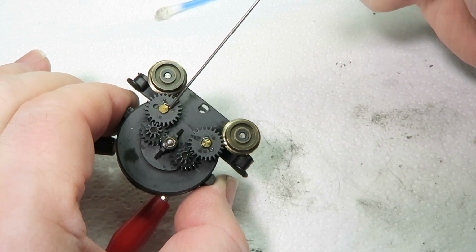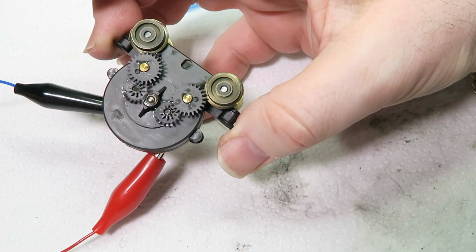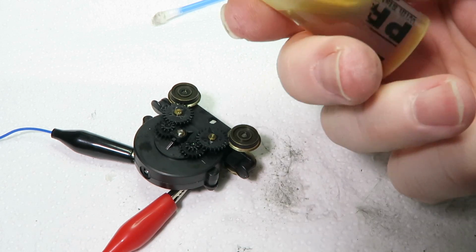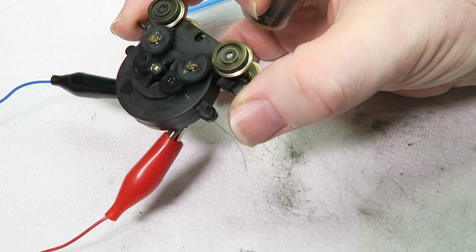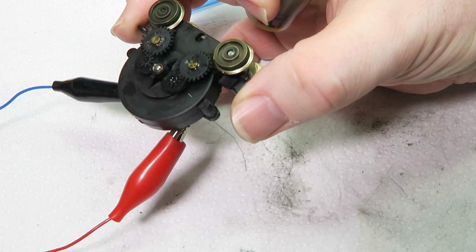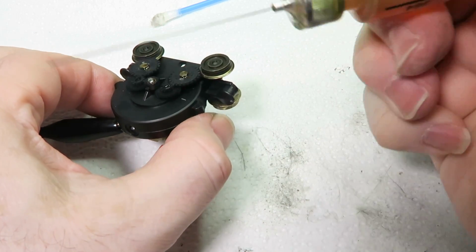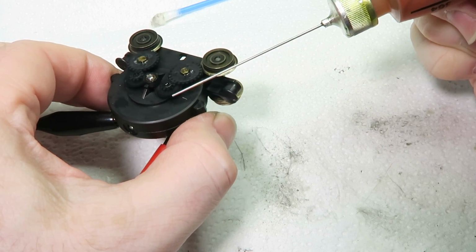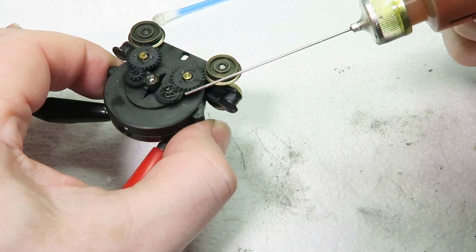It really is just a small bit, just so that the plate, the face of the cog, can move freely against the bolts. So now comes the fun bit. This is putting on Hob-e-Lube gear grease. So we'll get her turning a little bit slower than that, and then what you do is you get the grease coming out and just web it on to the gears like you can see there. You get that satisfying little cobweb effect.